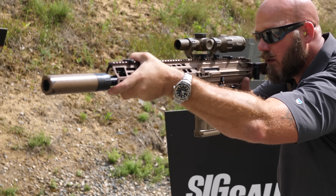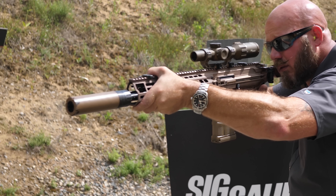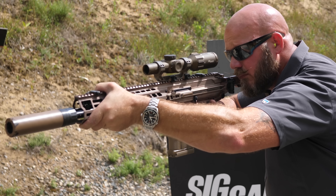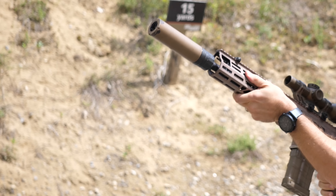There was a lot in the ether and we've nailed down some details at this point. So Jason, walk us through the line of the next generation of pistol and rifle cans coming from Sig. Before we really get into the specifics on each individual can, let's just talk about where Sig Sauer is going. We've stepped away from the traditional stacked baffle, welded baffle — suppressor stack inside of a sleeve — and we've moved now to 100% additive manufacturing. So we're printing all of our cans.